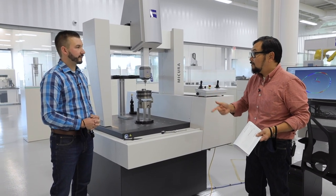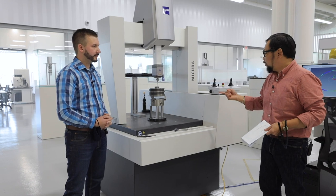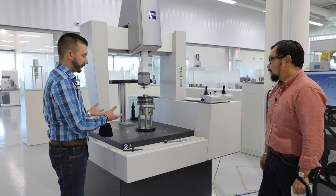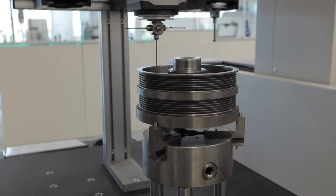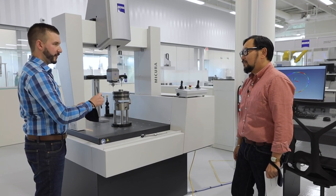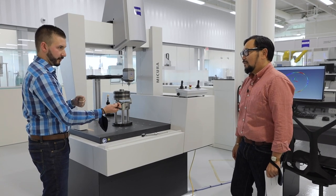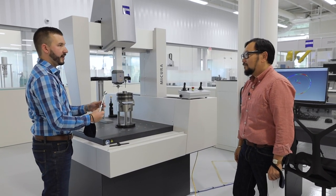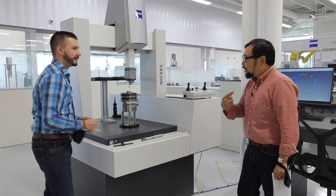Can we dive into each one of those? Of course. I have four different stations set up — they're all going to show us good and bad examples of how to pass a gauge R&R. So here is a really important part of a gauge R&R: fixturing. Every gauge R&R is most likely going to require a fixture, and what's important is that that fixture is repeatable. On a chuck like this, we could use something like a chuck key which is going to tighten the part. The problem is each operator is going to tighten the part a little bit differently — there's no consistency. Operator one might tighten it pretty light, operator two might go a little bit heavy. Additionally, the same operator might not be consistent from part one to part two to part three. So we can make an easy move by switching this out to a torque wrench. You can set this to a known setting and then we have consistency in how much we're tightening that part. Seems so simple, makes sense.